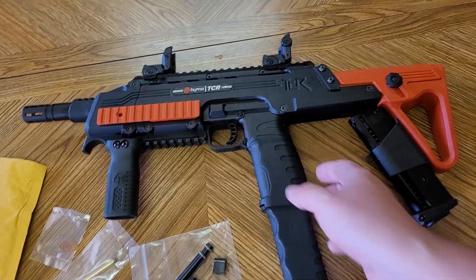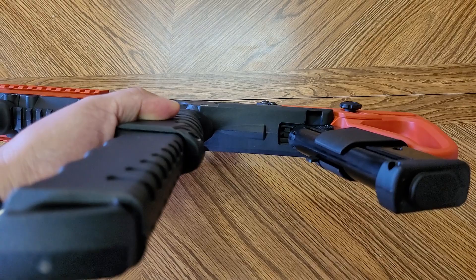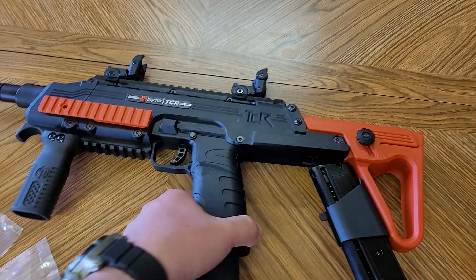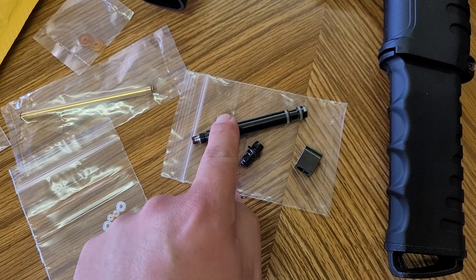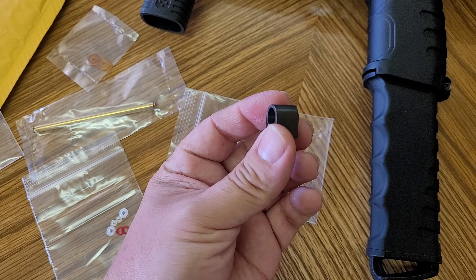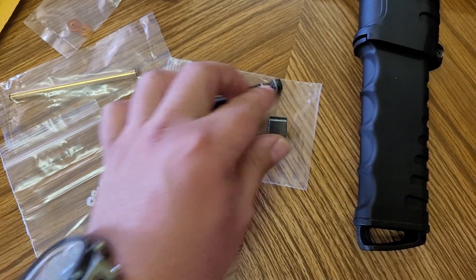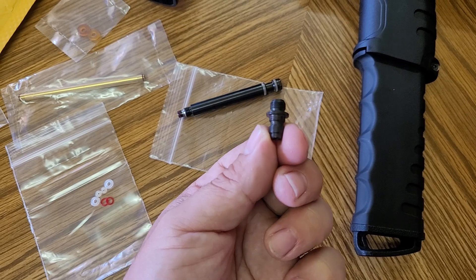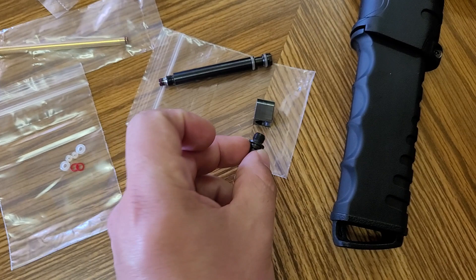You'll need to carve out some of this plastic on the housing, remove the shell, remove all this stuff, and then once you're in here, you put this fill extension on the back of the regulator. Then this is a swivel sleeve that will rotate on here, and this is what actually connects the remote line — it's like a quick, eighth-inch quick disconnect — and this threads into the swivel connector.